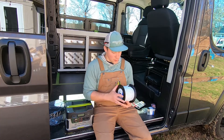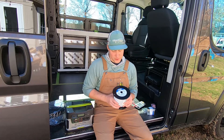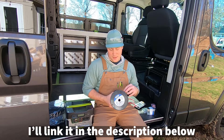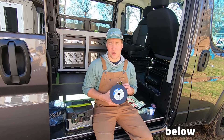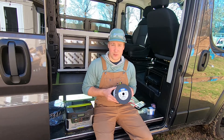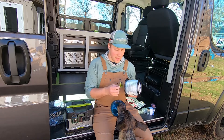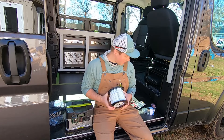To power those things, we're going to use 14-gauge wire. I planned to go with 12-gauge originally, but looking over a gauge diagram, it was alluding that 16-gauge would be just fine for lights and fans. I thought 14-gauge would be a little safer, a little more peace of mind. It's marine-grade with multiple strands — just a positive and negative.